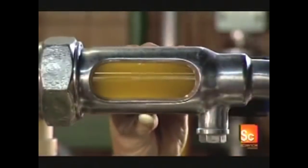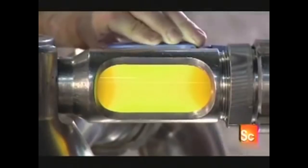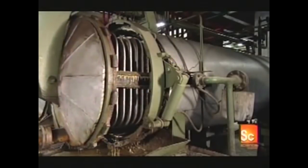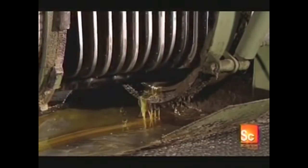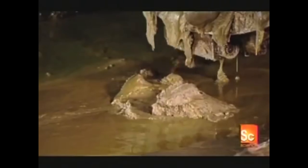After this cleaning process, the canola oil is visibly clear. However, it still contains natural waxes, which makes it look cloudy. So the next step is to cool the oil to 41 degrees Fahrenheit, which thickens those waxes so that they can be filtered out. The waxes don't go to waste either — the factory uses them to produce vegetable shortening.